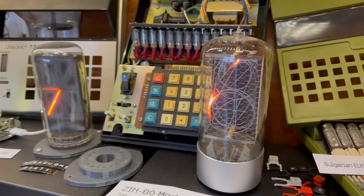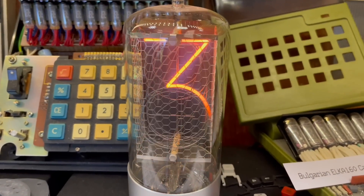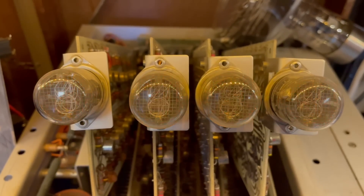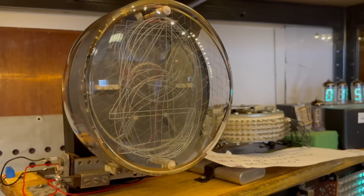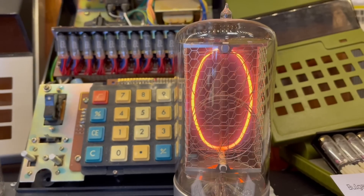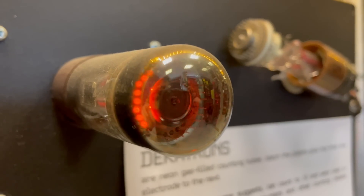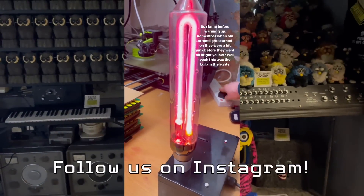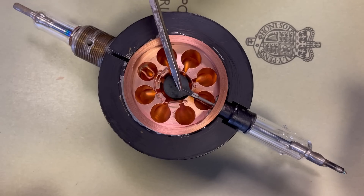This was the only way they could do things for a long time until the transistor was invented. Some tubes, like these Nixie tubes, only have partial vacuums inside and you're intentionally colliding particles together to release energy — you see the photons as light. Filling the tubes with different gases gives different coloured light: neon gives a nice orangey glow, argon makes a lovely purple.